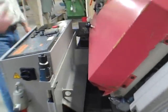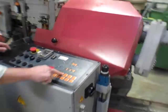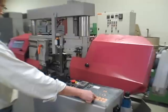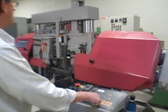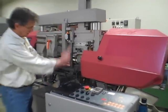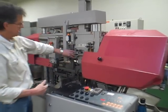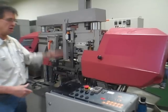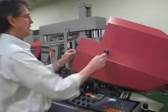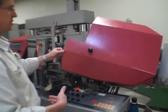If I raise it up, I can open this cover. Let me bring it up manually to show the other cover open. This is a T-bar right here. It comes down until it hits the nest — once it hits this, that takes it from fast to feed. Since we don't have anything in there, we're going to go into feed only for the last half inch, which is the hydraulic control valve right here.